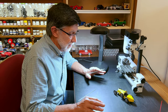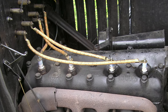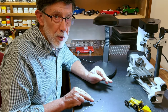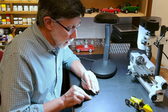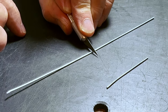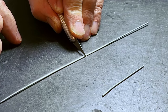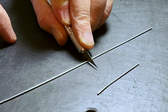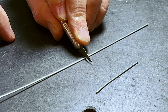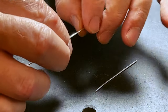One of the challenges I haven't solved yet is how to replicate cloth-covered ignition wire that was used in vintage cars — you know, spark plug wire. What I've tried is taking aluminum rod, cross-hatching it, and painting it. If you want to cut a piece of aluminum rod, you line up your X-Acto at 90 degrees to the rod and roll it back and forth. Each successive pass the blade falls into the groove, and once you get a pretty good groove you can just snap it.